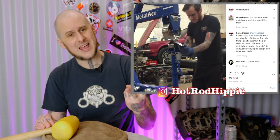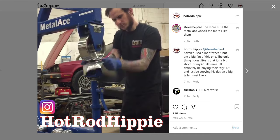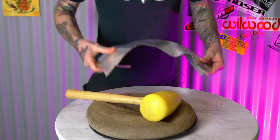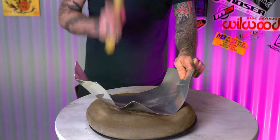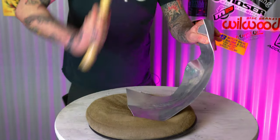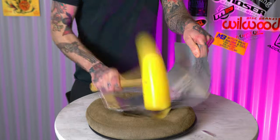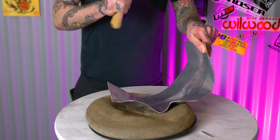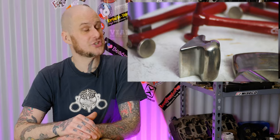If I'm really trying to create a fender shape out of this I would end up going to either the English wheel or the planishing hammer to smooth out between those different points — going from high point to high point and blending the area in between. Since this is a blocking hammer video I'm not breaking out the English wheel or planishing hammer. To smooth out those high points I'm going to flip my hammer over and use the lower-radius end to blend between those points, striking into the shot bag at lighter pressure for a more uniform shape. You can also use a hammer and dolly to smooth out the metal but it will take significantly longer.